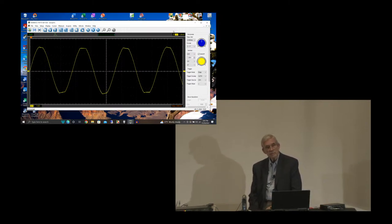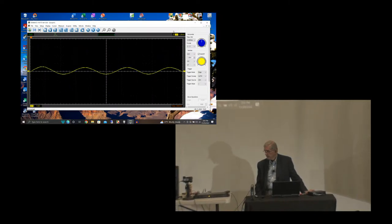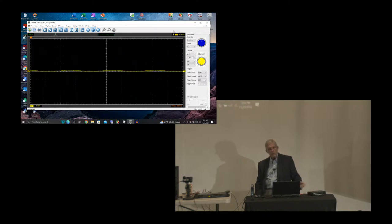Oh, now what's happening? You're all of a sudden hearing it. It can be pretty significant. Now, in the old days, they used to have woofers and the horns were 500 cycle. And when you'd hit that point where the amplifier was clipping, you would really hear it a lot out of a 500 cycle horn. But this thing probably crosses at about 3,000. There's not an awful lot of energy up there, but there still is energy. Now we're playing this, and this amplifier is not supposed to be putting anything into that horn at all because the tone is very low. And yet when you run the amplifier into clipping, you're all of a sudden hearing it.